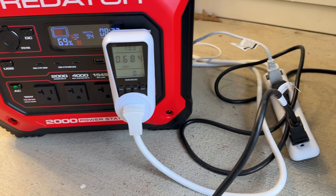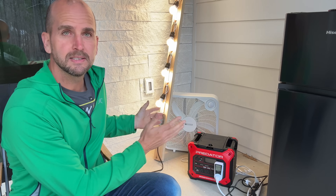For a real-world scenario I have a refrigerator, a fan, and a string of LED light bulbs — a small home setup. This is actually for sizing a system to power homes in Haiti, a future project on the channel, but it also makes for a great 24-hour test. I ran the Predator for 24 hours powering this circuit and also ran a competitor EcoFlow unit, using a separate small power meter to measure actual energy consumption pulled from each unit — giving us data to compare usable capacity versus rated capacity.